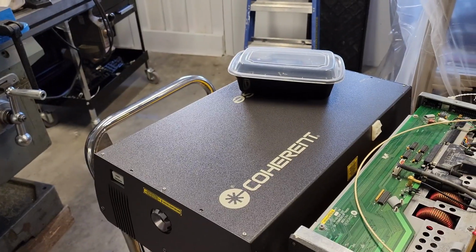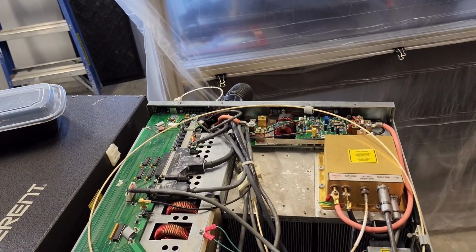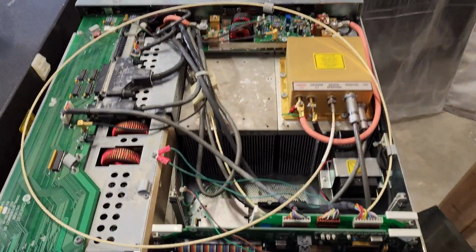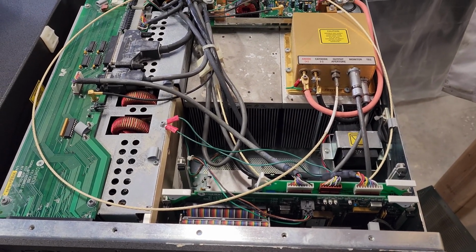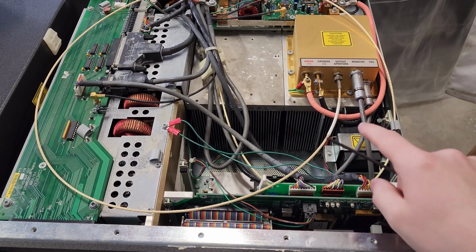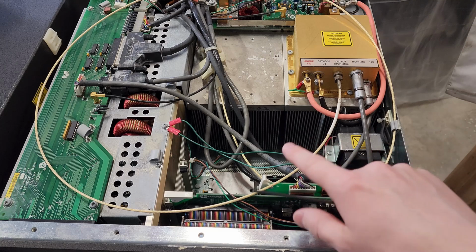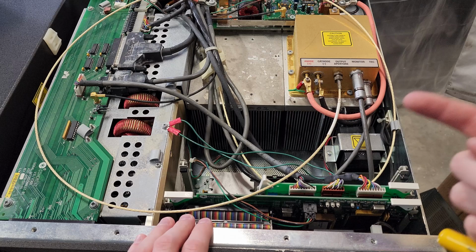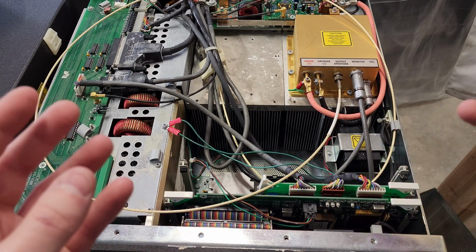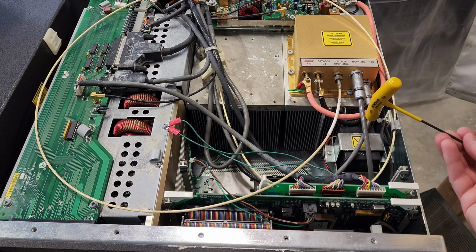So, when I mentioned the battery backup inside of here, this one, I believe, is designed so that if this system loses power, it has enough juice in it and the control board smart enough that it just runs the heating element in the crystal long enough on battery power so that it can slowly ramp its temperature down so that it doesn't damage the crystal when it cools off too quickly. So that's kind of the whole point of the battery backup.